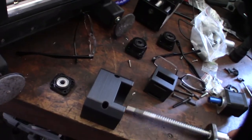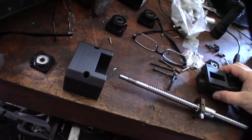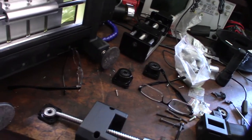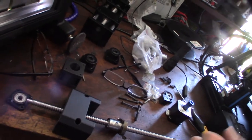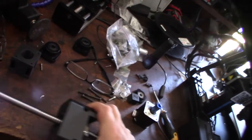Alright, so it's been a couple days since I've started working on this. I had to actually design a couple parts here - this is actually going to be for the extruder, I'll show that to you once it's on there. And this is the actual adapter plate that goes to the bottom of the bed, and it just goes like that. I printed this out in 100% infill carbon fiber PLA. With a CNC machine, weight is your friend, whereas with 3D printers you want to make it as light as possible because if it becomes heavy you get a lot of jerk - but with the CNC machine you want it to be as heavy as possible. I'm gonna upload all this to my Thingiverse page, so if you guys want to do this conversion you'll have all the parts to get it done.